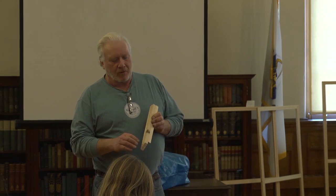If you do have knots in them, try to use the stock in a way that you discard where you have imperfections and flaws. You may have a pitch pocket in the wood, or knots, or checks in the wood, or wane. Wane is when the edge of the wood is almost up against the bark. You want to end up with as much really clean, straight pieces of wood as you possibly can to assemble.